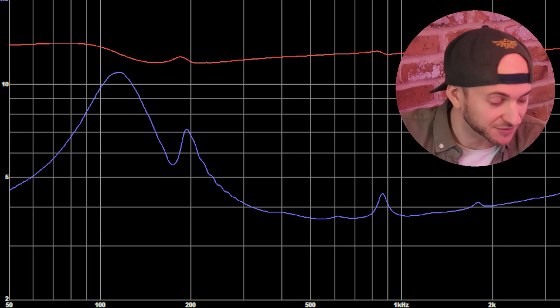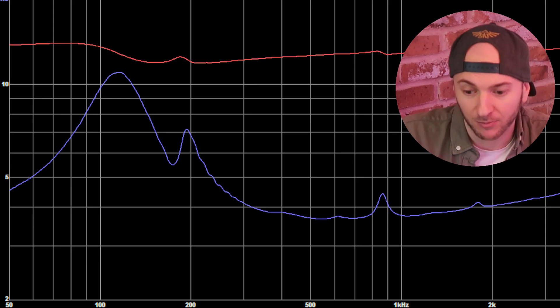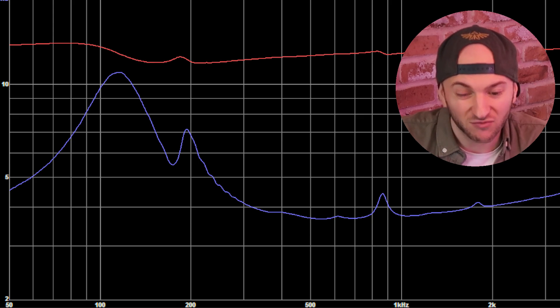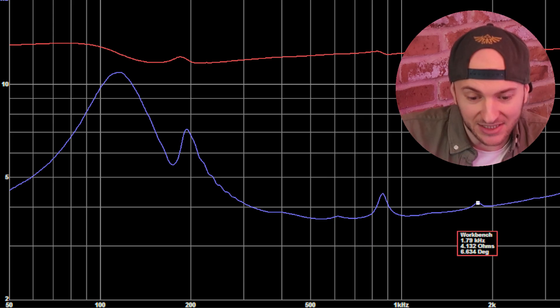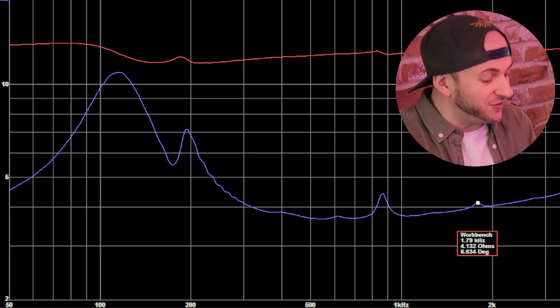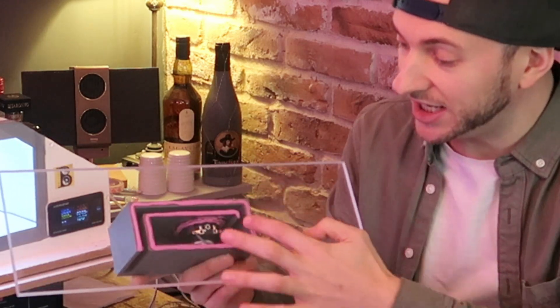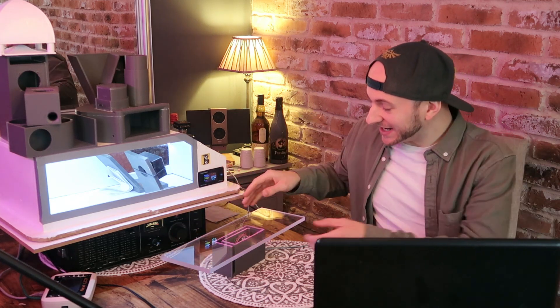The next two frequencies, 270 and 360, have much less impedance rise, so we're probably going to go all the way up to 15 watts on those. Interestingly, there is another relatively pronounced impedance spike up at 866 Hz, and another one up at 1700 Hz — about double. So those are definitely quarter-wave modes of some kind, whether this is like a T-line style enclosure or just modes bouncing between the two parallel edges. Pretty interesting, and although I don't necessarily think this is going to be the loudest box we've tested, I think it's still going to produce some reasonable output.